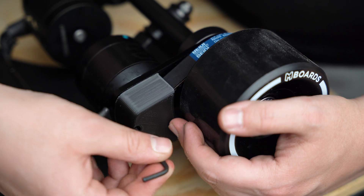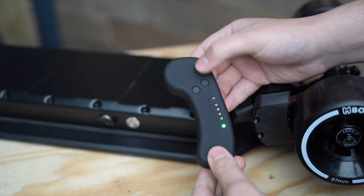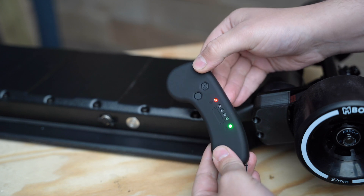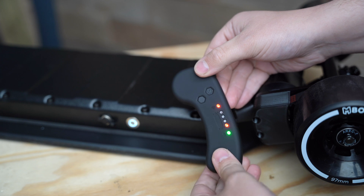This is something you should do while setting up your FOC box, but if you need to pair your remote, here are the steps. Begin with the remote and the board powered off. Turn on the remote, hold down the speed mode button and the power button at the same time — the remote will vibrate to indicate it is in pairing mode. Immediately turn the board on and your remote should pair right away.